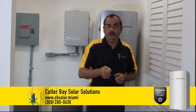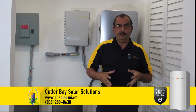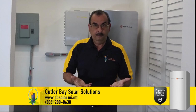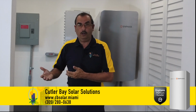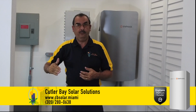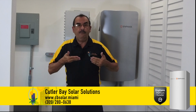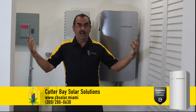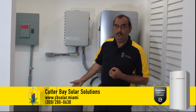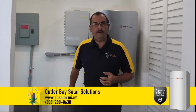And you can be in charge of your power. You can be in charge of what you're going to run and what you're not going to run during an emergency circumstance. You're going to have the ability to monitor your power consumption and the amount of power that is already stored. You're going to maximize by having the panels running your house first through the 200 amp transfer switch and only using the battery to supplement if you don't have enough production. So your house needs 8 kW, you're not putting 8 kW from the battery during the daytime. During the daytime, you're putting 6 kW from your solar panels and only 2 are coming from the battery.